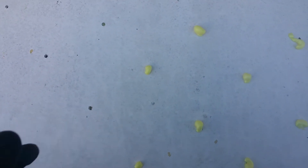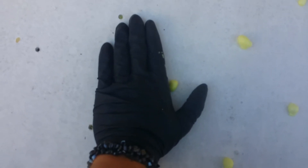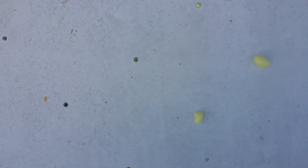The first step is to drill a test hole and confirm it's hollow. You can do this for any part of your boat that's hollow and you want to shore up. Once you've determined you want to fill it with foam, go back and create a diamond grid pattern — spread the holes evenly about this far apart. You want to make the holes big enough so the hose can fit through them but not much more, so the foam stays inside and expands in the hollow cavity.